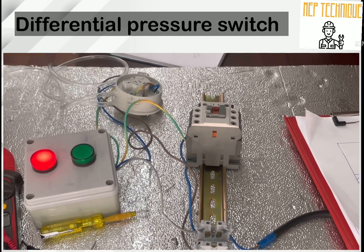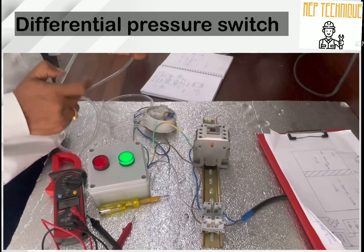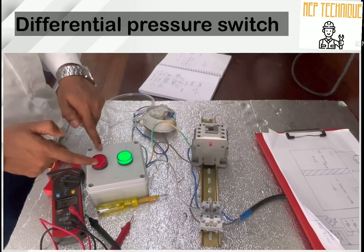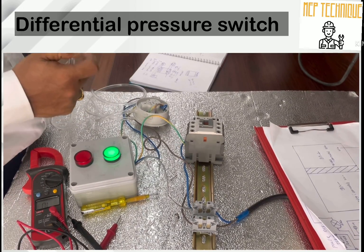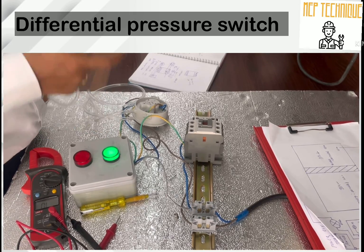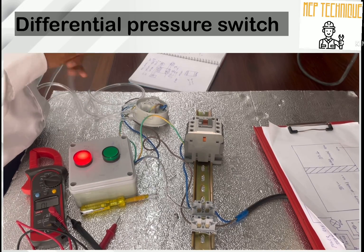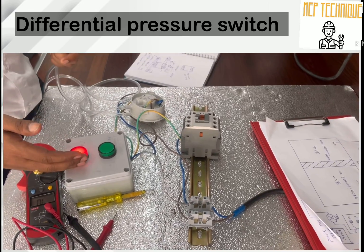This is the positive pressure and this is the negative pressure. I will now apply some positive pressure. You can see the contactor has latched and the ON indication is lit. This happened because when I gave a sufficient pressure difference, it latched from trip to ON. If the filter blocks, the pressure difference changes, the contactor will turn off, and the trip indication will activate.